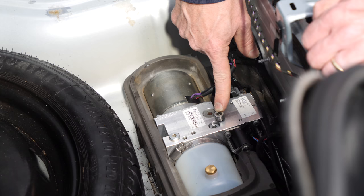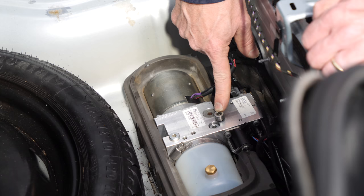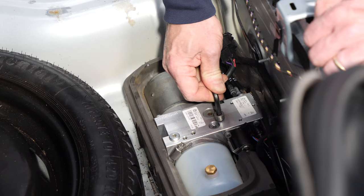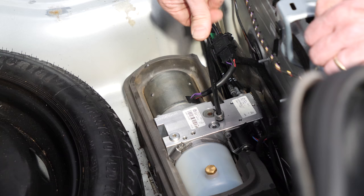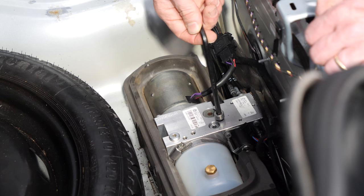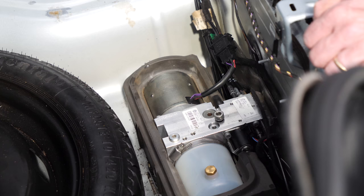Here's what we were after — the manual pressure relief valve on the hydraulic pump. It uses a 6mm Allen wrench, or a Torx T40 will work as well. You want to unscrew this counterclockwise. Give it a half turn, then another half turn — about one and a half turns total. If you were to turn it farther, at about two turns you'll find it gets harder to loosen. You don't want to go past that point or you'll damage the valve. So let's bring it back to about one and a half turns open.